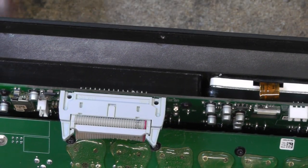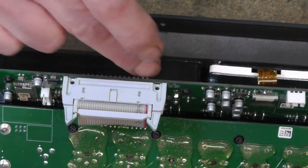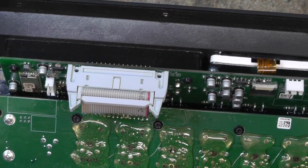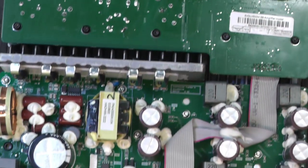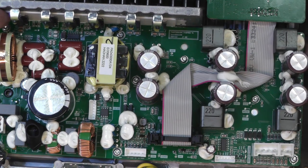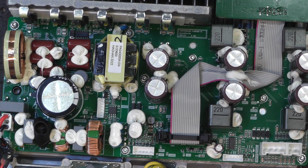It's basically connections underneath the board here. There's two lots of them. It's fiddly, but it can be done. Just take your time. And that's really it. It's just a matter now of double checking your work, making sure there are no short circuits on the joints where you've soldered, and putting the module back into the base bin. Cross your fingers.